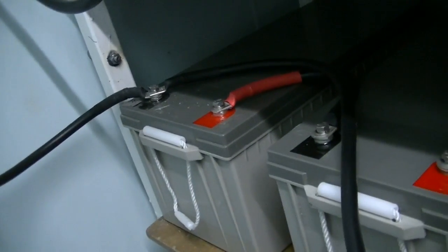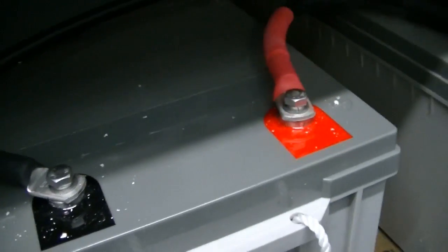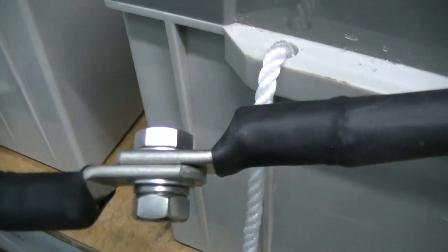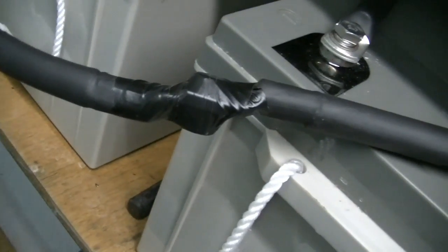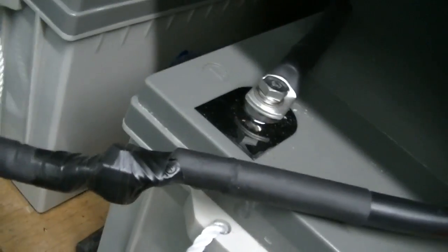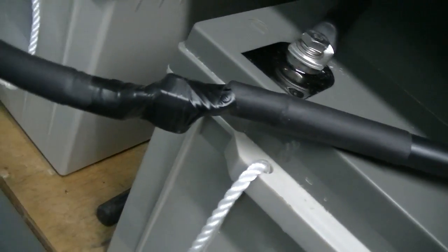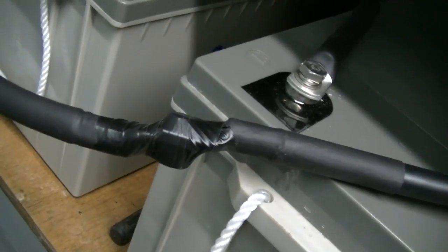Basically I've got to run the neutral from there, skip that neutral, and go to the second cell of the batteries. What I'm doing where I'm disconnecting it is just putting some stainless steel bolts and spring washers and joining them together — just a bit of added safety. I've covered it with insulation tape, so if I need to undo it and put it back to 24 volts, I just take the tape back out and change the lead cables and bolt it back the way it was.